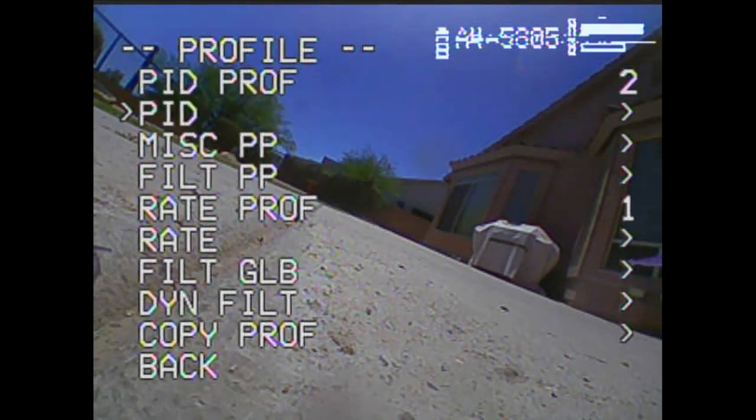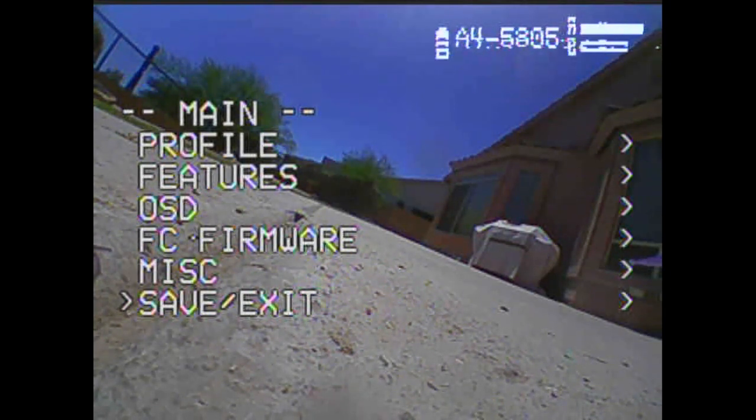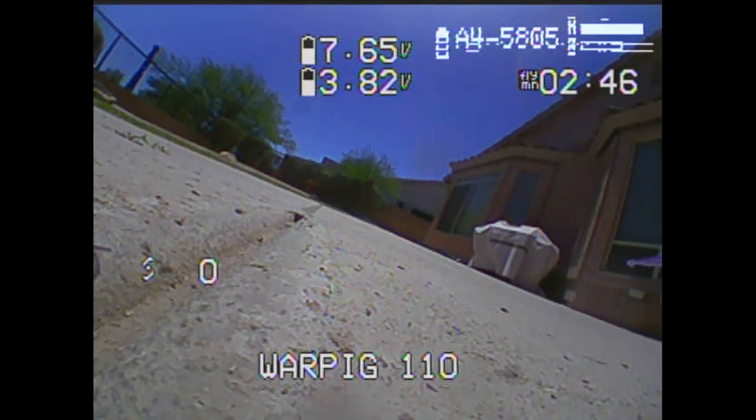The reason for that is: one, this quad is pretty symmetric, and two, I don't have a black box and I can't really tell the difference between the different axes without one. What you can do is based on the assumptions of your weight distribution - after the fact you can push up one and drop the other a little bit. On the heavier axis you may need a little more PID; on the lighter axis you might need less.